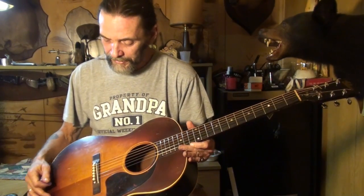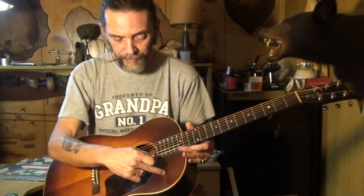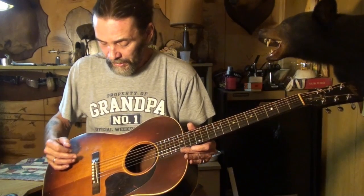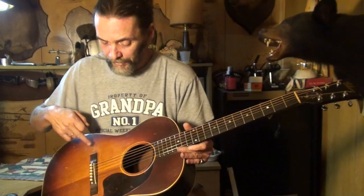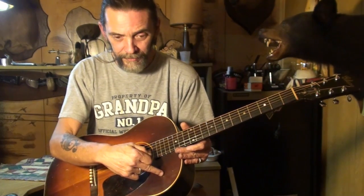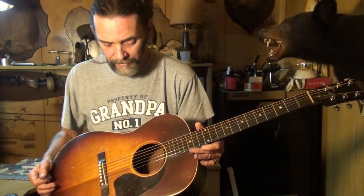I think we had, let's see, 1, 2, 3, 4 braces down here loose on the top. The top one's up here on the upper half, we're okay. On the back, that's 4 braces. On the back we had 1, 2 on this brace back here, 3 on the third brace, 4 on the second brace because the entire braces were not glued, and the lower half here, 5. So that's 9 glue joints loose. That's not counting the bridge glue joint on the bridge we had to do. 9 glue joints. Well, no, 10 if you count this crack in the side.